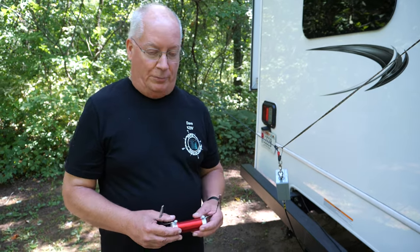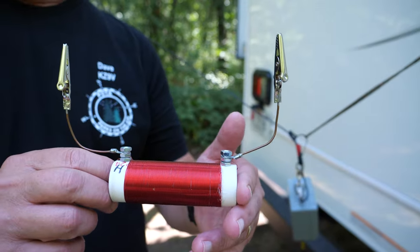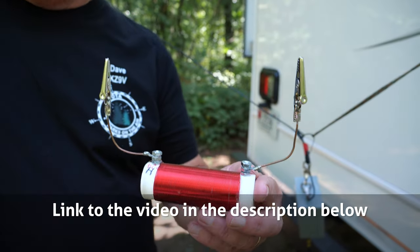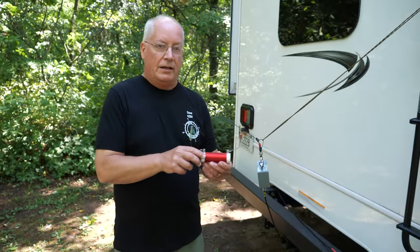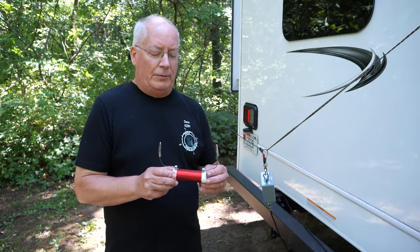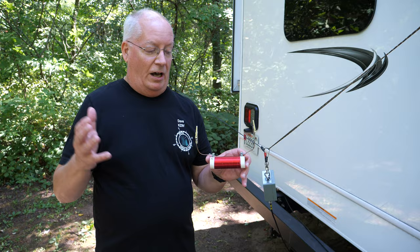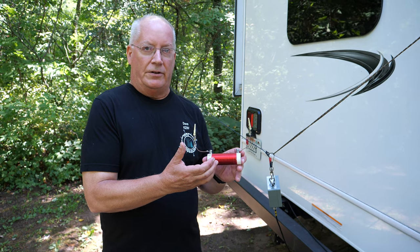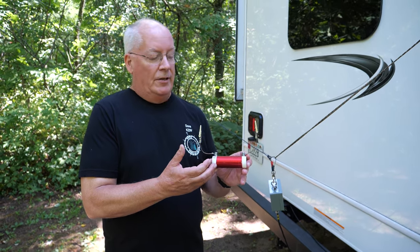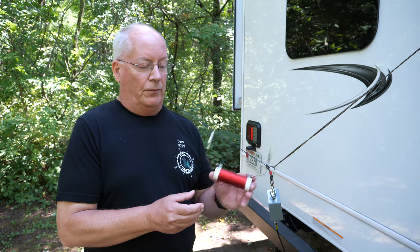So I came up with an idea a couple of years ago where I could take this coil, which I homebrewed — it's basically a 110 micro Henry coil — and you attach it to the far end of the 67 foot wire, and then with the appropriate length whip on the end, you can actually make this NFED work on 80 meters. Problem number one: you have to get this on the end of the wire, which if the wire is elevated, that's tough. And the second thing is the bandwidth, because of the coil, is very, very narrow — 80 meters is 500 kilohertz wide and with this coil you only get about 70 or maybe 80 kilohertz. So you have to be very careful when you tune it.